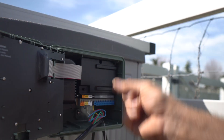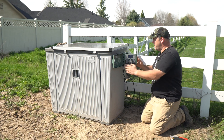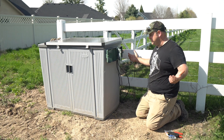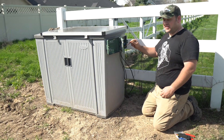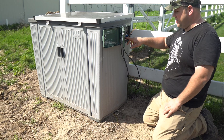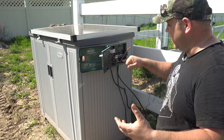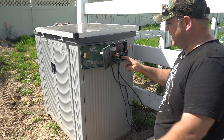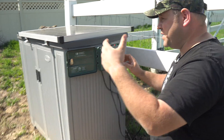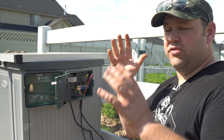Almost can't make it easier to wire — you just shove them in from the bottom. So then I've got my control box. This is on the outside of this unit here because it's in an enclosed box that's literally made for being outside. All of my wires from all the valves are coming into this one box. The white ones just go where the white goes, and the colored ones just plug in to the associated number. Yellow was valve number one, so I've got it in spot number one. When it's time to program the unit, station number one will be whichever valve goes to whichever wire — so station number one for me will be that valve that waters the trees.